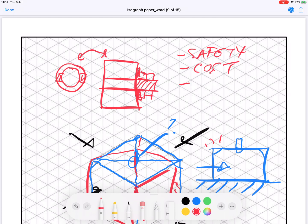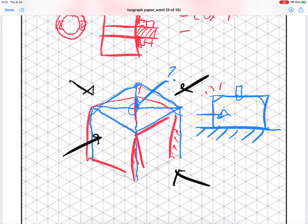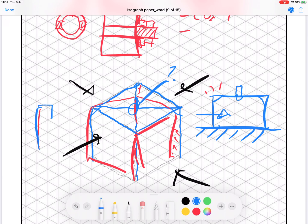Talking about the structure itself, if I just scroll down, I've made a little picture here. So what you have is your cross brace section. If I was to draw a picture, sorry, I'll just change the colour of that. You've got this cross brace structure here, which is very good. You can look at that as a two-dimensional plane, and it's very stiff in this direction. My main concern is that the forces going through the structure vertically are fine, but you need to consider forces from other directions, so lateral forces going in the horizontal planes.